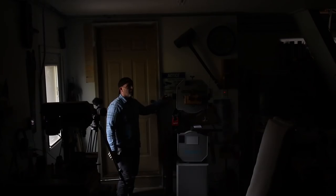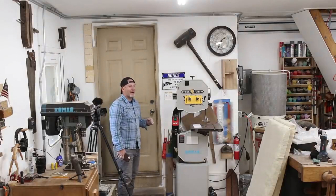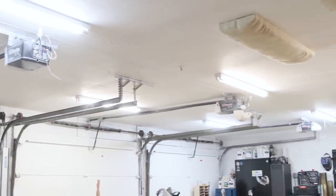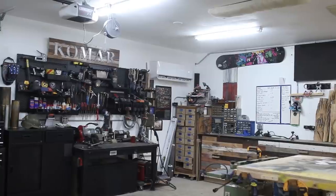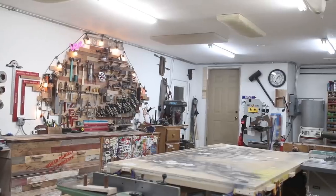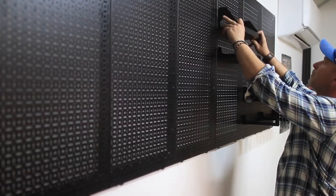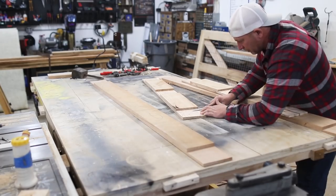Moment of truth — let's turn the shop on and see what it looks like. All right, here we go. Oh, it is so bright in here. So now I have a total of nine light fixtures, each holding two bulbs. Six of them at 5,000 Kelvin, which give me the brightness that I need. And for a little bit more of a warm feeling, I installed three light fixtures down the middle with 4,000 Kelvin. And I know that mixing Kelvins is not optimal for filming, but together these bulbs give the shop such a unique look. And I just love being in there now, not having to move all the different lights around and actually see what I'm doing. So I'm very happy with it.